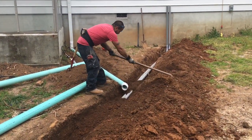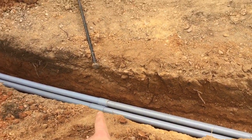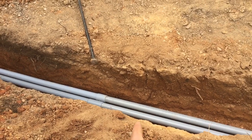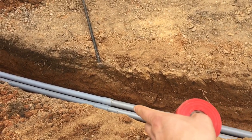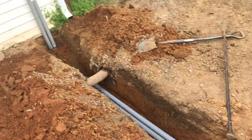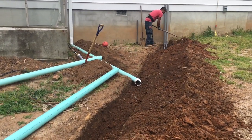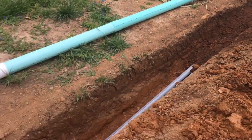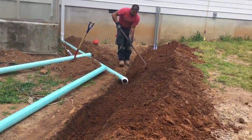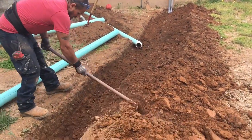When you run your conduits, be mindful of which direction the bells are facing. You want your bells running downhill — the idea is that as you pull a wire, you'd pull with gravity, so the wire slides against the bell end in the right direction. We almost always bury a 2-inch pipe — because why would you bury smaller? Why go to the trouble of putting in a pipe too small? You might as well not run a pipe at all.